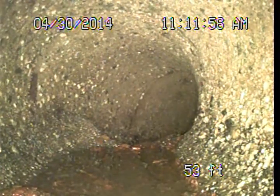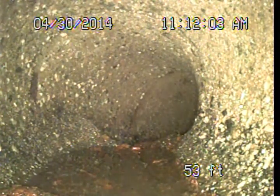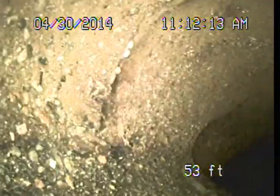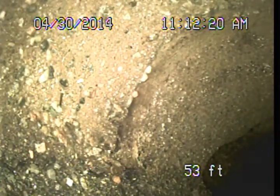We really want to make sure that nothing was hidden or covered up any damage. So we're getting up to the area here, making that connection. This is where we have those significant roots and what looked like soil buildup. You can see the joints and the connections here at the elbow fitting just over this hump and our wye fitting into our city sewer. Nothing obvious as far as damage or a break. I don't really see any reason to recommend any sort of repair as far as excavation. One may want to consider a lining system on this older concrete pipe — eventually it probably will deteriorate to a point where it would be beneficial, but at this point I'm not seeing anything that would tell me it needs to be done now.